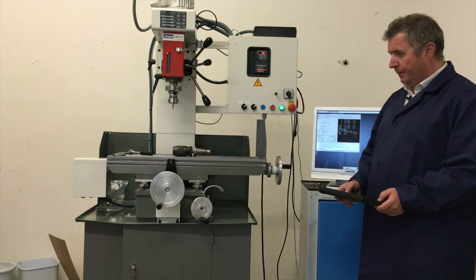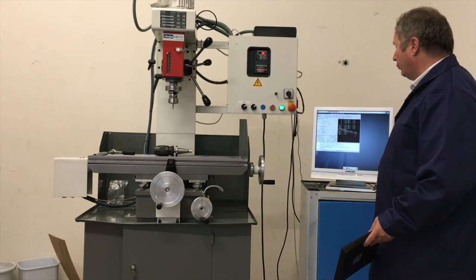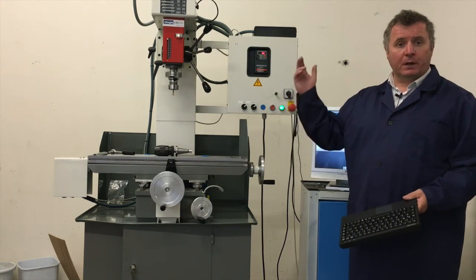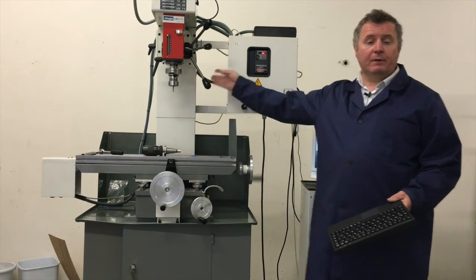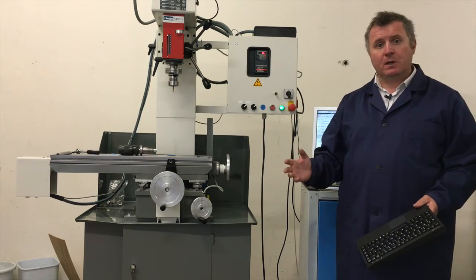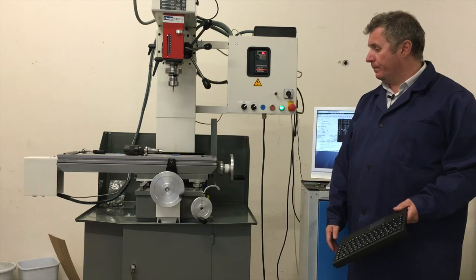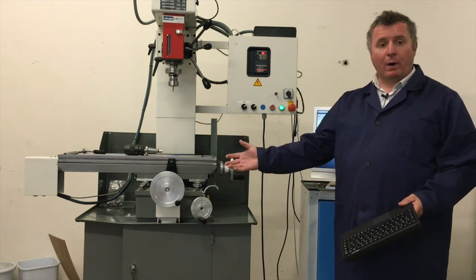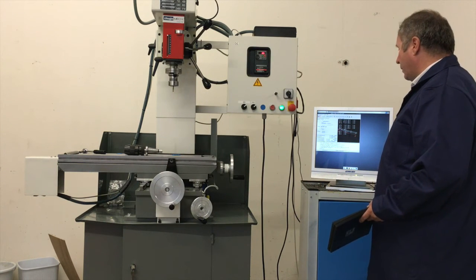You can drive by key or use your mouse. Now we do a reference drive. This is the interference from the long Z axis, and sometimes the metal guards give you some noise. But we like the metal guards because they protect the spindle from hot chips. Now you see the referencing is going on. The Y axis is now referenced, and the system is ready to go — you can see it on the indicator poles.